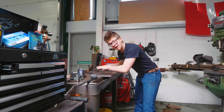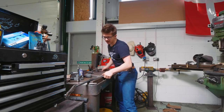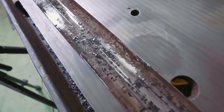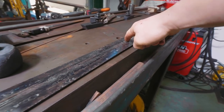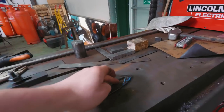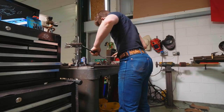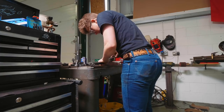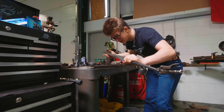This gray here is an indication of martensite forming, which as far as I understand is a wonderful indicator that we got a hard blade. It looks like there's a little tiny bit of a bow — turn it over — yeah, this has a slight bow going to the left. It doesn't look too terrible, though it's pretty bad. Let's see if it's hard — oh yeah, hard as glass. The entire blade is completely hard. This is fantastic.